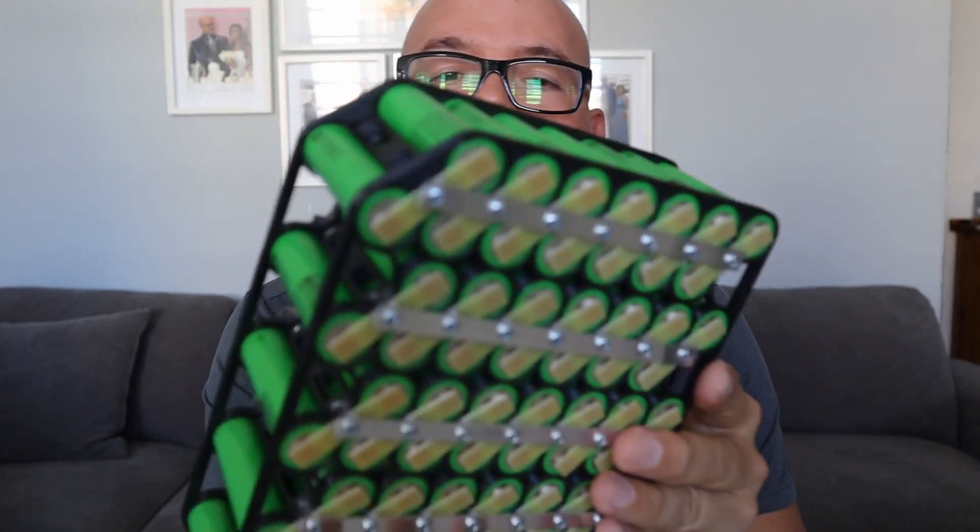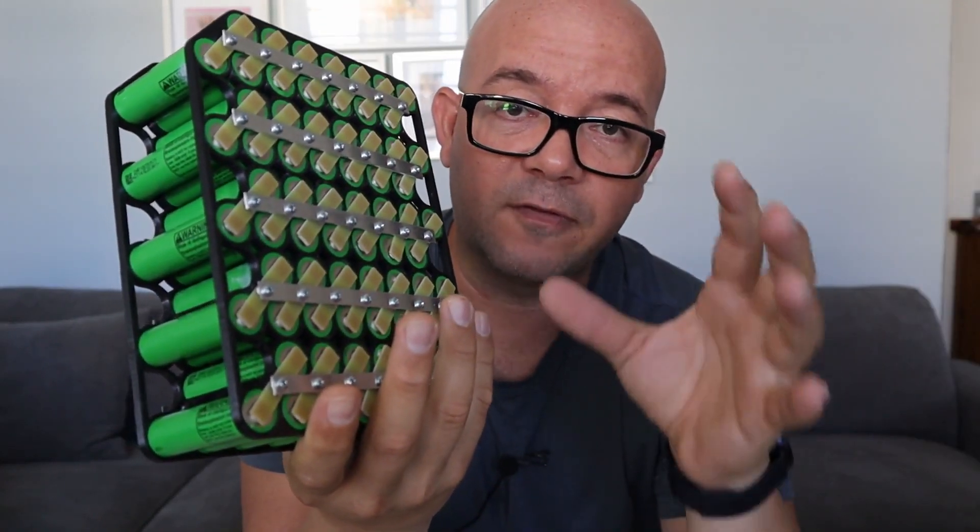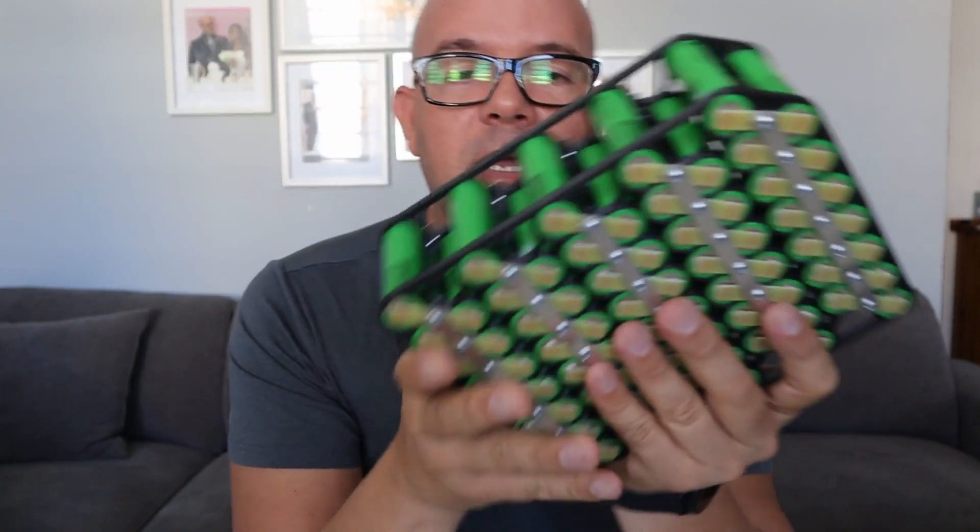Say hello to my little friend. This is a massive 70 cells in parallel that are connected or pre-connected in parallel. Every single cell is fused on each side. You have a much, much less amount of screws and bolts. And also, it is based on my first design. Instead of using a spring clip or a spring, we are using the PCB as a compression bar. We already ran some tests with it and it turns out that PCBs are strong enough for you to bend them, and they will keep enough force on them because they want to go back to their original position. The pieces are small enough and affordable enough that in case you have a fail because it loses shape or strength, you could just change it.